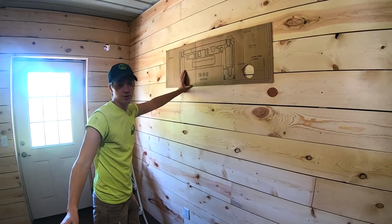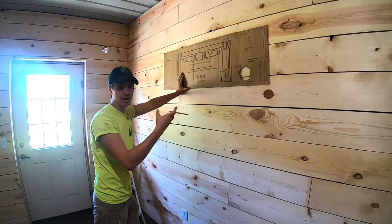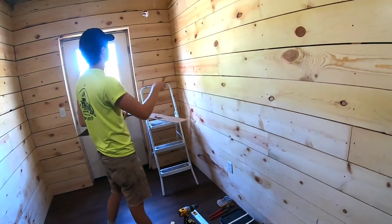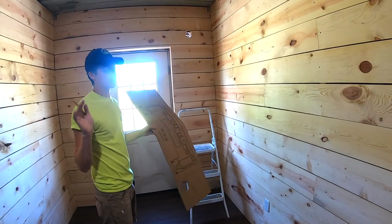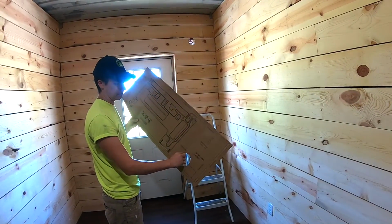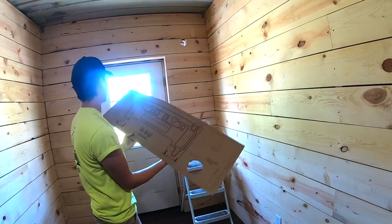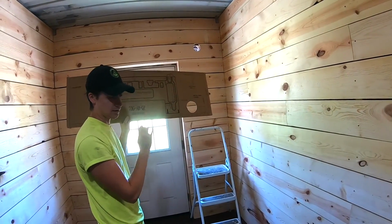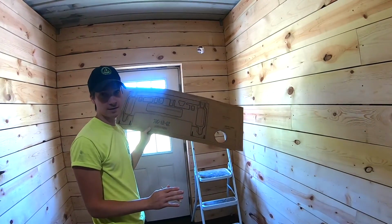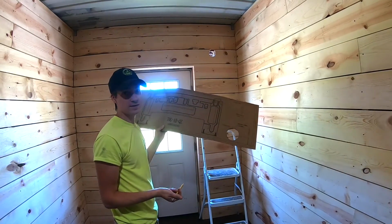This is just to ensure that all the water draining from the indoor unit drains out and doesn't back up and then start leaking down your wall or anything. So for our purposes, since we already have our hole drilled due to the fact that this is just a giant steel box, I already cut out the recommended measurement on this template. So I'm just gonna line that up and then make sure it's level. And I would recommend maybe getting some tape because it makes this whole process a lot easier. But then I will mark my mounting points and we'll be on our way.